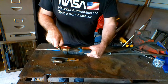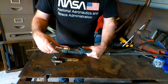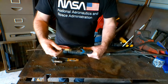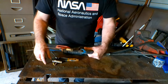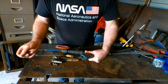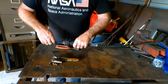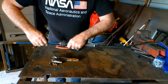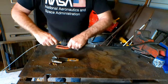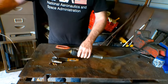Next, take off your contact tip holder. Be careful when you take that off because some of these torches have a ceramic swirl ring — this one here is like a silicon one so it doesn't really matter, it bends and buckles. So take that off, and then hopefully we can grab the other end of it and pull it through. So we'll just lay it out flat again, grab a handful of it — a lot easier this time guys. See that? Yee-haw! There we go — it's our wire stuck in our liner.